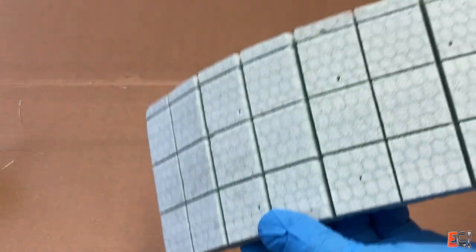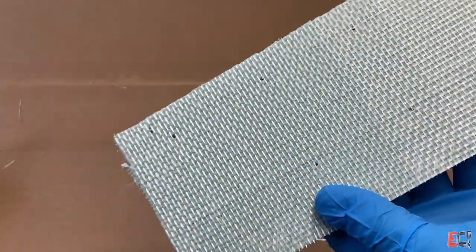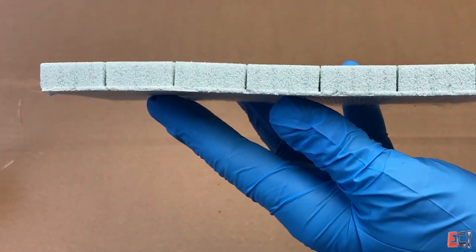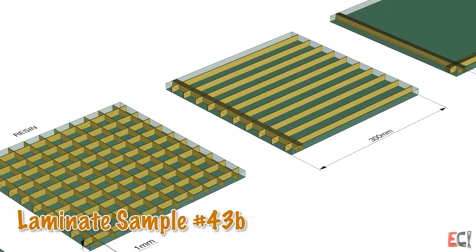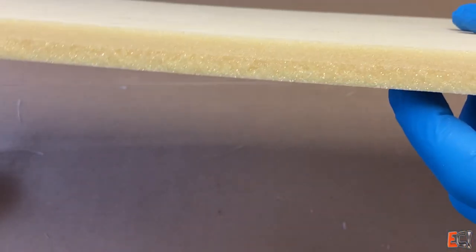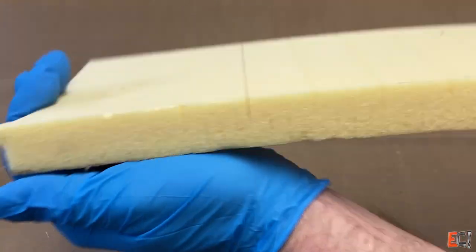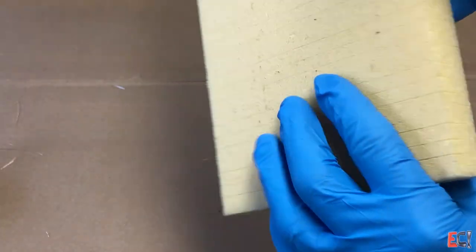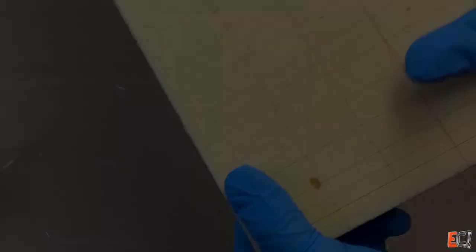Here's a look at the core. There's a contour scrim, 80 kilo core. It's got some pretty big kerfs in there. In the next video, 43B, take a look at the volume of resin that a contour scrim soaks up. An alternative, especially for flat panels, is core with just perforations. Here is some double cut and on this side triple cut core that takes up a lot less resin in an infusion process and still provides conformability.